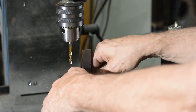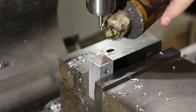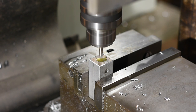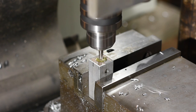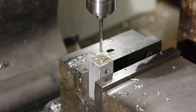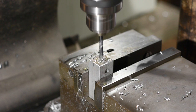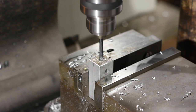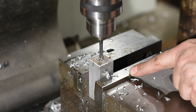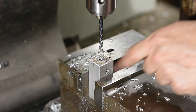Next, I'll reset the stock, making sure it's nice and square before drilling. I'll drill a very short pilot hole, then use a number 7 drill, which is the recommended drill size for a 1/4-20 thread. I could use a bottoming tap here, but instead I'll just run the hole a little bit deeper — actually all the way through the other hole — that'll give plenty of clearance so that the tap will run the threads all the way to the base of the part of the hole that I need threaded.